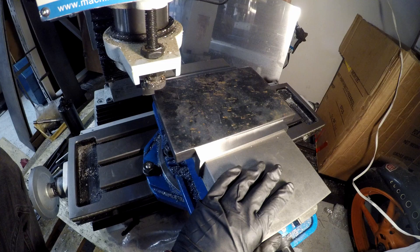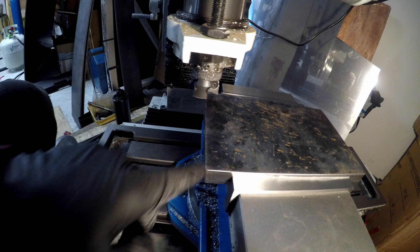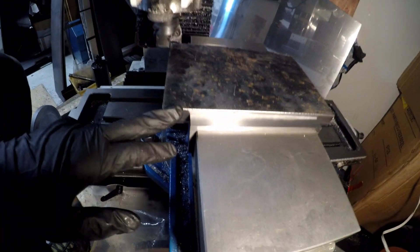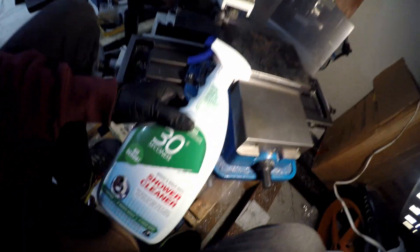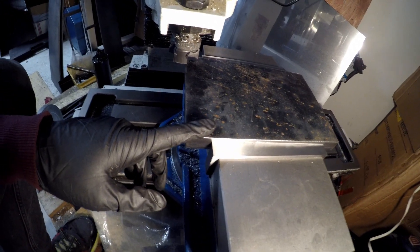I have the BFV back in the mill with the bit of steel in there - got it pretty flat. The plan is I've got the carbide, going to take the metal off the top, then I'll change tooling and do the sides while it's in the same position, then flip it and do the bottom, then flip it 90 degrees for each remaining side. For coolant I have a spray-and-walk-away bottle filled with water to keep the carbide cool.